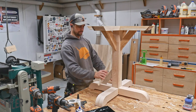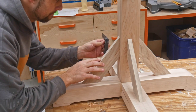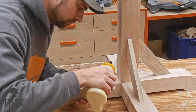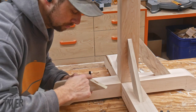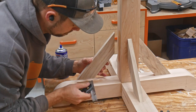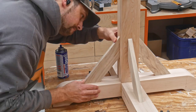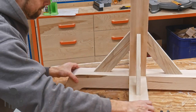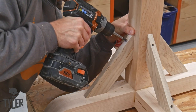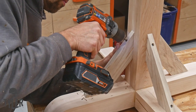This is going to be a table where people lean and sit on all four sides, so we need good support. I'm adding diagonal pieces also made out of maple, spaced out very well with a square to quickly put each one in place. I'm using TiteBond quick-activating CA glue to hold everything while the TiteBond II cures — the quick activator lets me push the diagonal pieces into place so nothing wiggles as I drill through and add a 2-inch Kreg pan-head screw, then cap it off with a maple plug drilled from the same species so the plugs kind of disappear. It turned out beautifully.